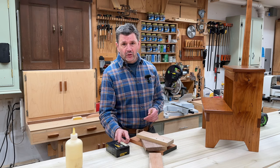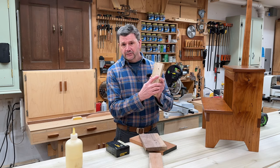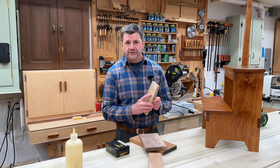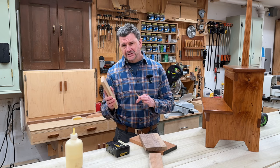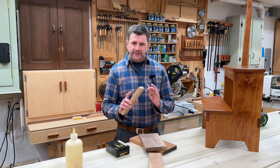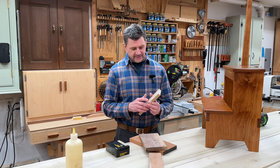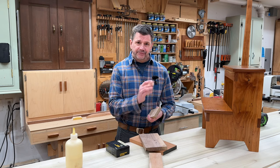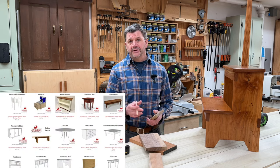I used trim screws because the holes are 1/4 inch. If you're going to use regular screws, you're going to have to drill either a 5/16ths or a 3/8ths hole — I think that might look a little clunky, but it really depends on the project. This is the kind of thing you just want to play around with. Get a few pieces of scrap wood and test it out first before you do something like this on your project.